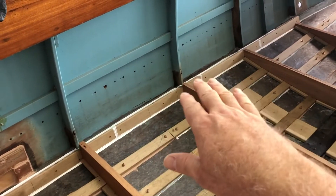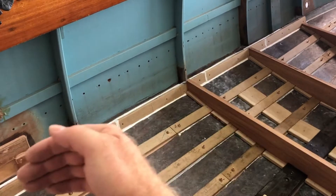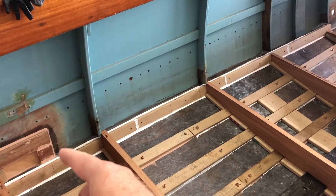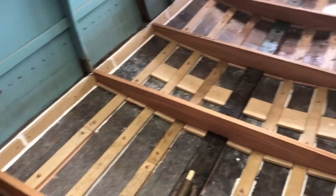There's more work to do there later on. On the outside of the boat there will be a chine cap or a rub rail in that area, and then eventually I'll bolt through the rub rail, the original chine, and then the new additional chine.